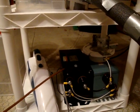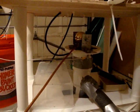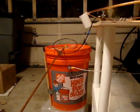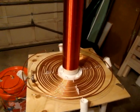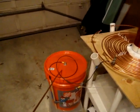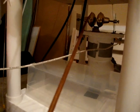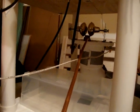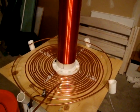This 12,000 volts is sent into our primary circuit, which contains a spark gap connected in series with a capacitor, which is connected in series with the primary coil. The transformer charges our capacitor, and when our capacitor reaches its highest charge, our spark gap fires and current is sent across it. When this happens, our primary circuit is short-circuited and a surge of current is sent through our primary coil.